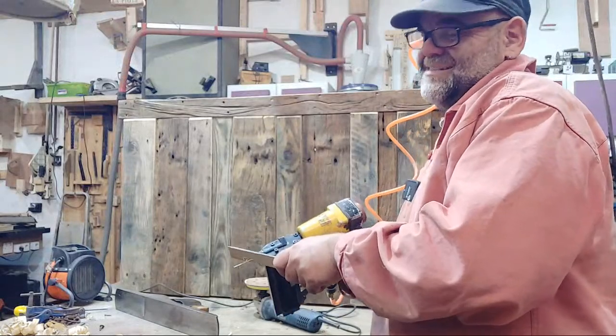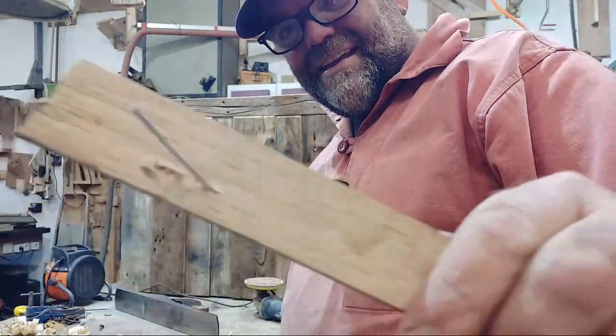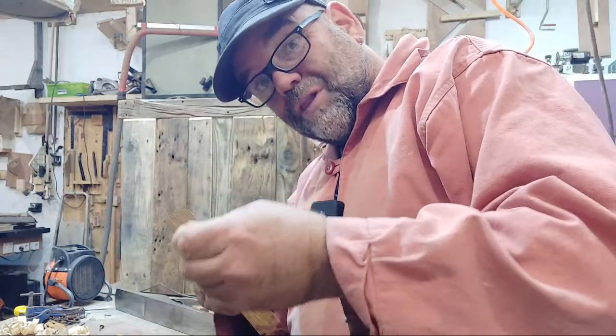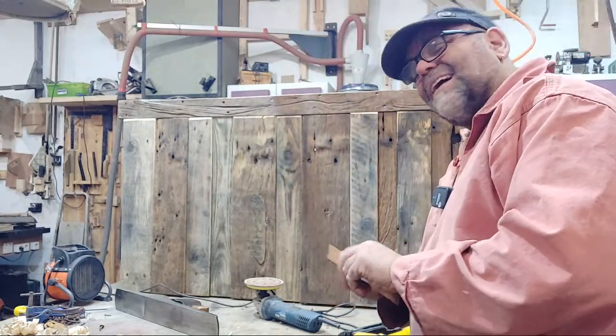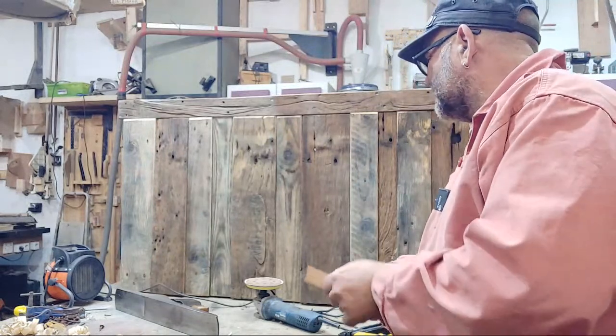Okay, I just went right through. Let's do it like that. That's it. They're quite skinny and quite long, so the likelihood is they could pull out, you see. So I'm going to be using some screws and plugs and what have you. If I get a couple of screws in each board, that'll be enough, and then a few nails as well, maybe, just to make doubly sure of it.